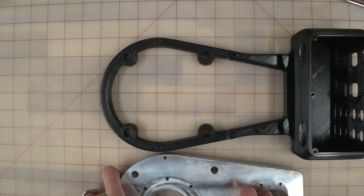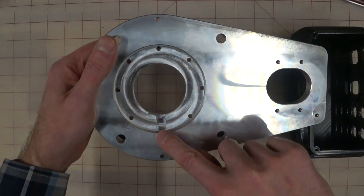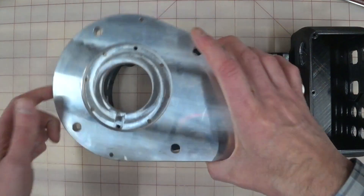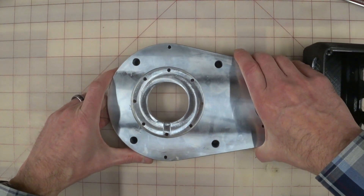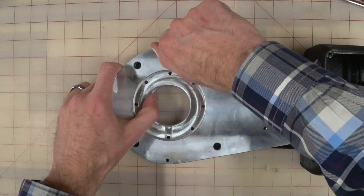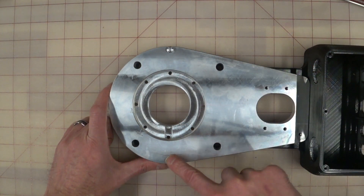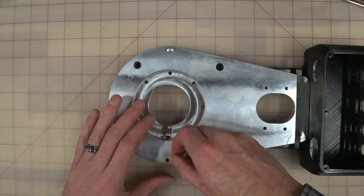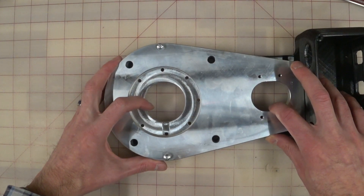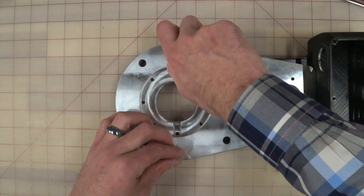Put your plate down. You're going to use these two holes here and put them into these two receivers — the two sockets we made earlier. If you did it all right, everything should line up, because you've got to have that line up with this. Now that we've epoxied that together it's not going to flex very well, and it's got to line up at the back. It turns out we've got just a tiny bit of wiggle room, but this is very, very well planned out.